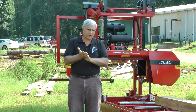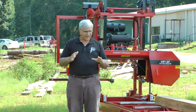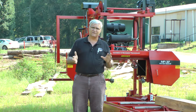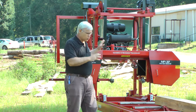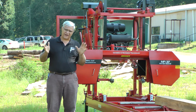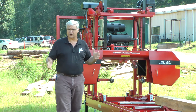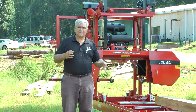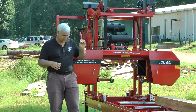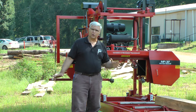So really the numbers we're looking for: if I don't have much horsepower, I would go down to 3,500 feet per minute for a small mill with small horsepower. If I have more horsepower, our MP-32s we set up to run around 4,500 feet per minute because of the horsepower and the size of the wheels. On the AC-36 we're running about 5,000 to 5,500 feet per minute. We don't want to go a lot above that — there's a point of diminishing return where that speed just creates harmonic vibrations and literal movements from whatever might be slightly off on the roller guides or band wheel.